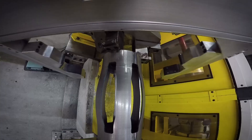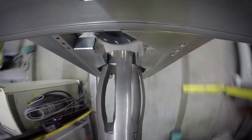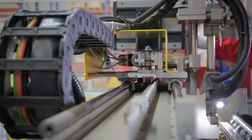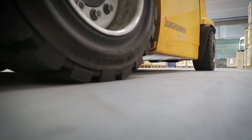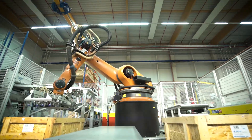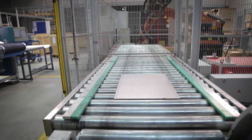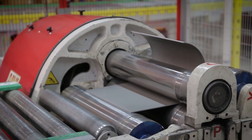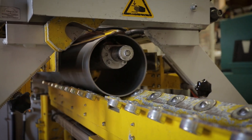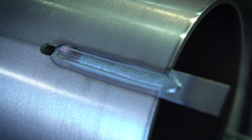This repeatable precision means not only a perfect fit on the casing, but also consistent performance in challenging wells. The machines use world-class alloys to form each centralizer. Without using any fillers, they weld two sides of the parent material together, which leaves a single, metallurgically invisible, resilient seam.